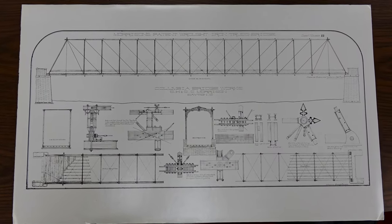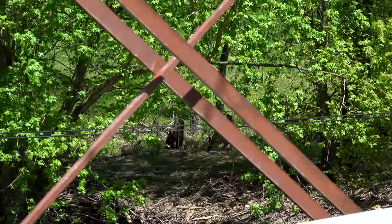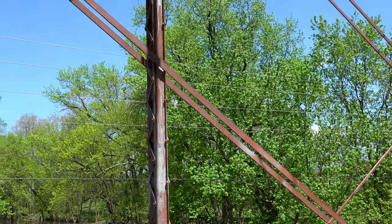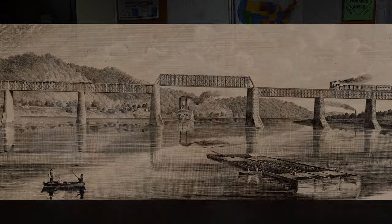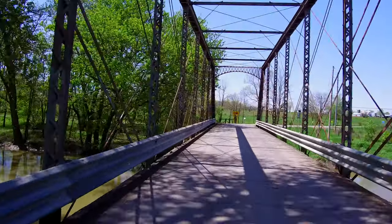For the Logansville Iron Bridge specifically, this is a form of a Pratt truss. In a Pratt truss, the verticals are always in compression and the diagonals are in tension. What's distinctive is that it's not a single intersection Pratt but a double intersection Pratt — the diagonals cross the first vertical and go to the second vertical. This type of truss was developed in the 1840s by the railroads for long-span structures, and when the first railroad bridge was built across the Ohio River in 1865, this was the kind of truss used. There are only about a dozen of these bridges still standing in the state.